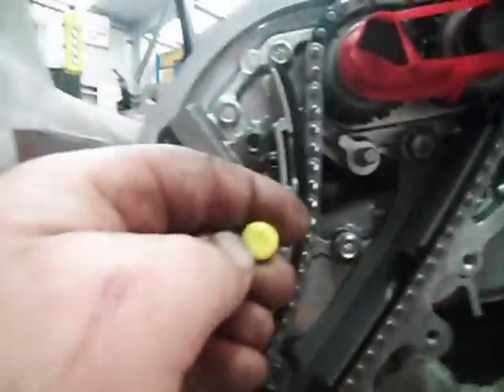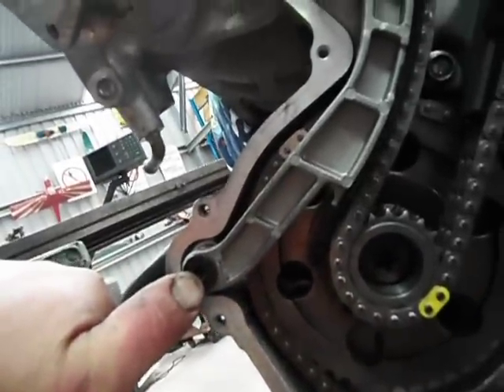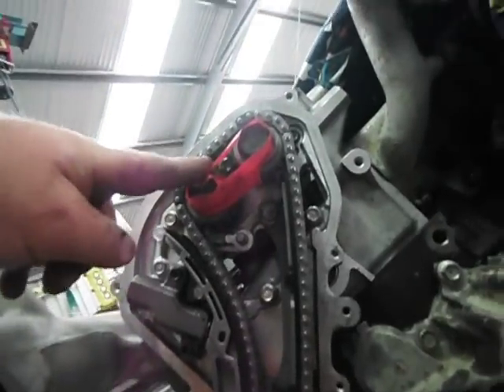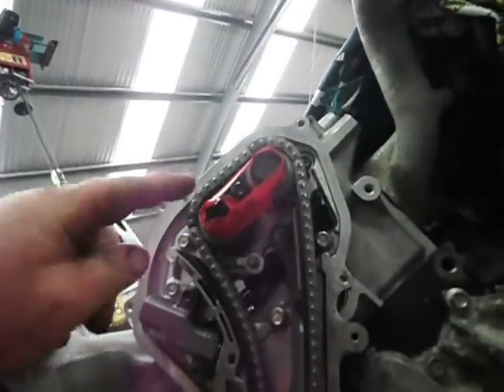The tension is set up — I pull the pin and there she goes. This has been tensioned up to 32 newton meters. They've been lock-tied, and the red tape just signifies that I've got to check the runout on the gears and tension those bolts up once I get it spinning.